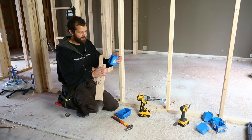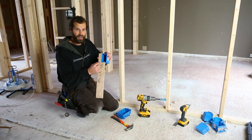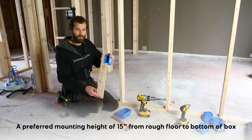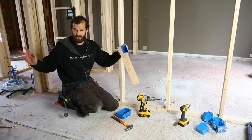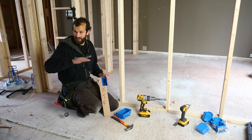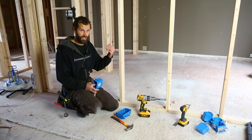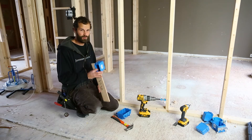This jig is also customized to the height of the box and the thickness of a 2x4 stud, which is an inch and a half. It makes it easy to hold and positions the box 15 inches from rough floor to bottom of box — that's our preferred mounting height. In this circumstance, this is an extensive $25,000 rewire of an existing house, so we're mounting to the existing standard of 12 inches. But our preferred new construction standard is 15 inches, and that's what I'm demonstrating today.